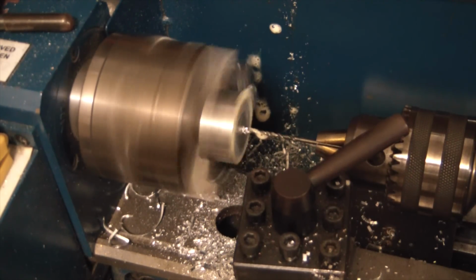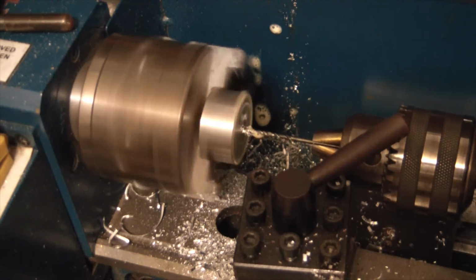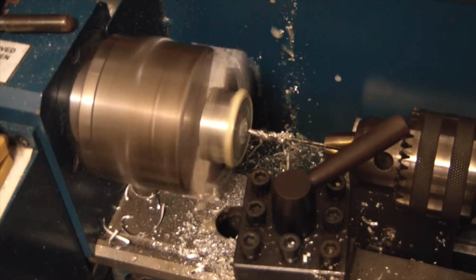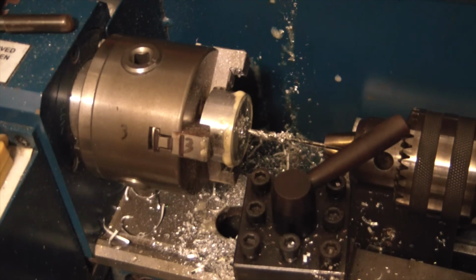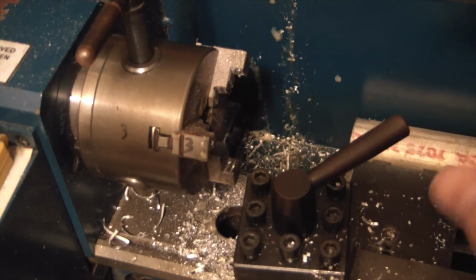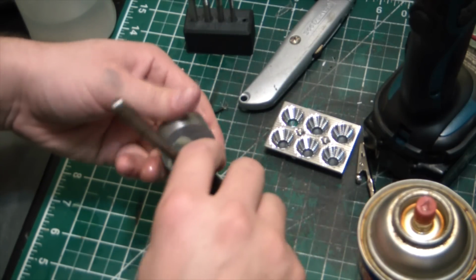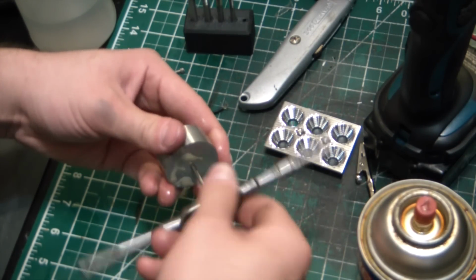Oh yeah. Just using a 2.5mm drill bit here for an M3. Alright, that should be plenty of depth. And I'll just tap her by hand on the bench. It is a blind hole, so I'm gonna have to get a little more cognizant of chips for the tap. It's a risky game here. This is my only M3 tap.